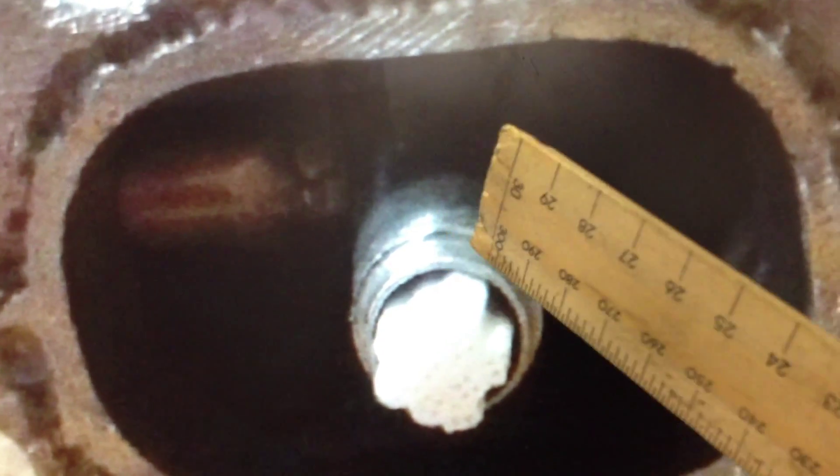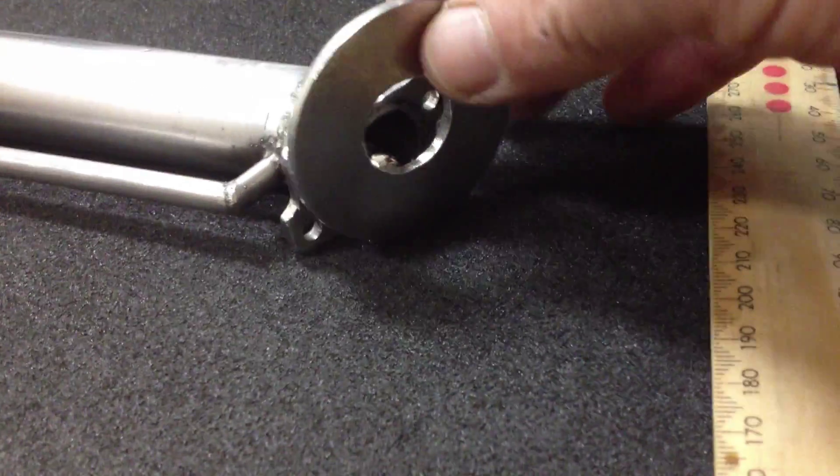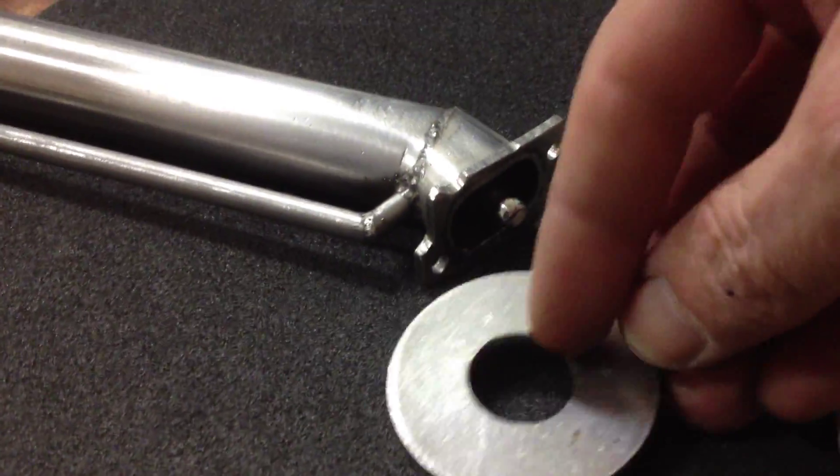There's the quenching tube in place when I was first fabricating the tube. You can see there's a machine ledge just out there. I've done that by hand with a tungsten carbide burr because I don't have a lathe or anything like that, so everything I've got to do I've got to do by hand. Same with the metal base — I've just made that by cutting up a washer, drawn the design out and cut it out with a hacksaw, then ground the inside out with a tungsten burr and welded it all together.